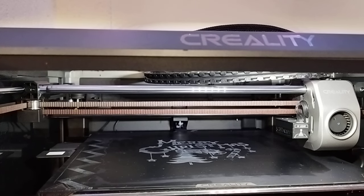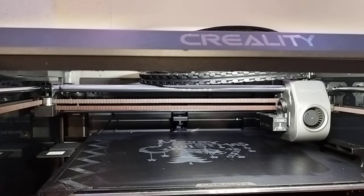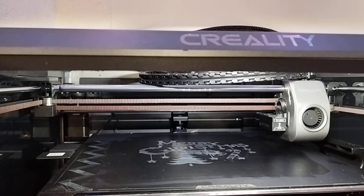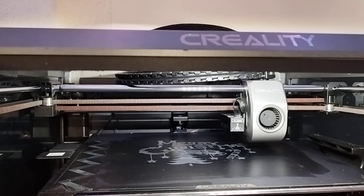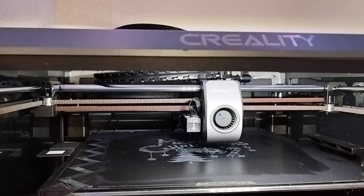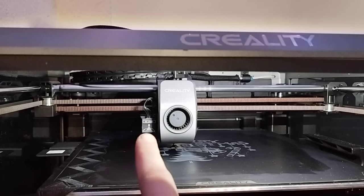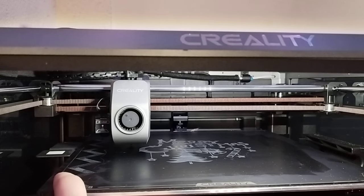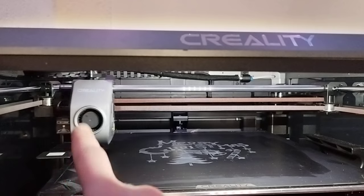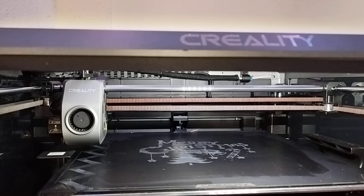It takes some time, but I just wanted to show you how the LiDAR works now and what is the logic behind the LiDAR and how it's scanning the surface. Because in the older firmwares, the laser from the LiDAR was also enabled here to scan these layers, but that's not how this was supposed to work. So for these layers, the camera must work here to adjust the flow rate, sorry. The laser should be only for the bed plate to see if any object or something like this is on the bed plate.